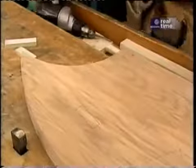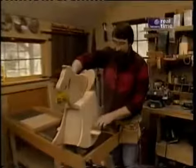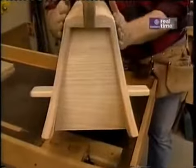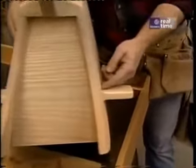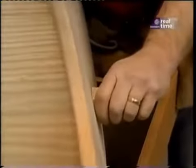With the two pieces separated, I'm ready to cut a mortise right here. Let's go over to our prototype and take another look. The mortise is for these footrests. And if you look at the rocking horse, the sides are tapered at 12.5 degrees. So if I cut a square mortise through there, my footrest is going to go in at an angle, and it certainly isn't going to come out on the other side. So the mortise will have to also be at 12.5 degrees.